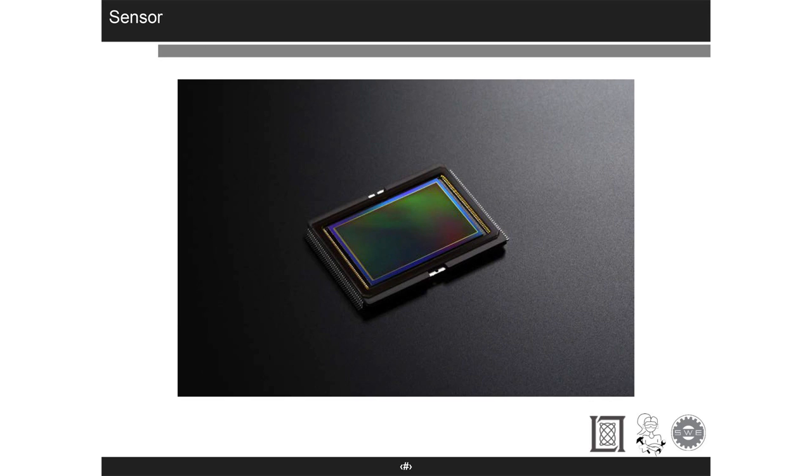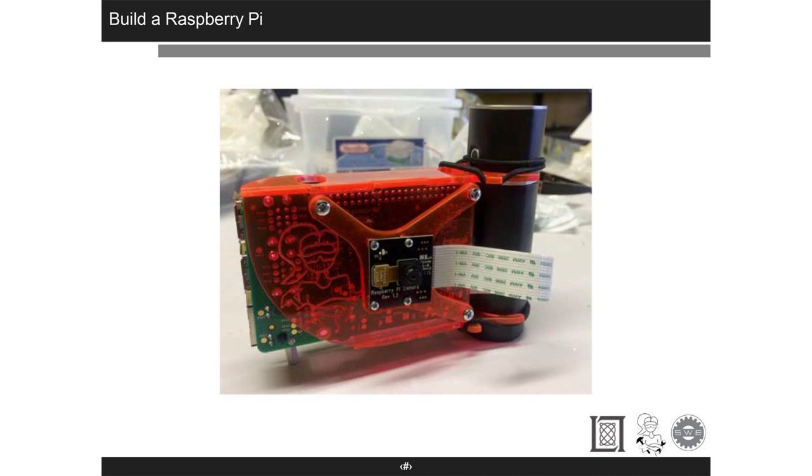This is a CCD. I'm not the right person to explain exactly how they work, but essentially they convert light photons to electricity. Then the computers in the cameras convert that to a picture and write it to an SD card. The cameras you're going to build are marvels of modern engineering — all of that lens, shutter, and focus is built into something absolutely tiny that costs about $25. All the image processing is on board the camera, and it sends data over a communication bus called SPI, which is a standardized communication bus.